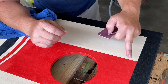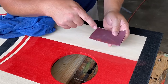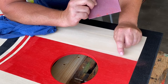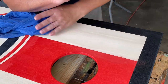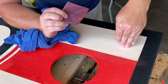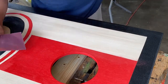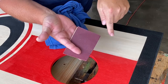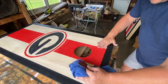When I start to sand this red area, watch what happens. We've got red in the sandpaper, and the red residue is now over on the unfinished wood. That doesn't seem to be a problem, but when we first started doing this I thought I could just take a rag and wipe that off — no. If you wipe this, it's going to push it down into the fibers of the wood, especially here in the Georgia heat and humidity. So you need to treat this just like I did the sandpaper: hit it with the dust rag, knock it off like that, and you can see it's gone now.